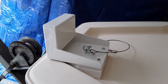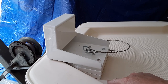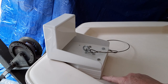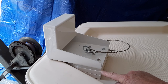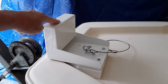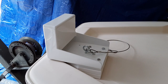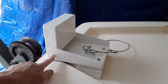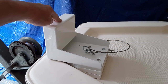This is my customized bow mount for this project. It's made out of painted aluminum, and as you can see, from the top of the gunnel to the casting deck down there there's a difference in height — roughly two inches. So I built up a base here using PVC board, which is rated for outdoor use, as well as some poly cutting board underneath, which also works well in outdoor environments. Over here where the main part of this mount presses down on the top of the gunnel, I added some marine outdoor weather stripping on the bottom of this plate so it wouldn't rub against the fiberglass finish and scratch it, and it also fills any little voids or gaps.